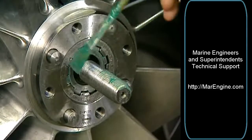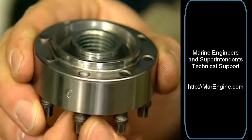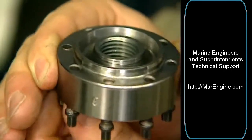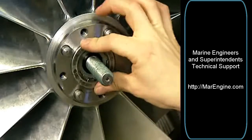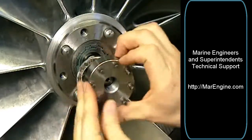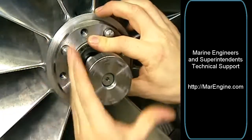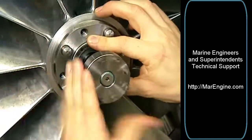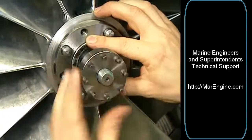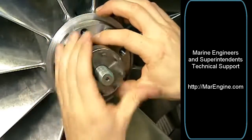Clean and lubricate the main thread with Molykote P40. Screw the thrust screws fully back. Attach the pressure disc to the compressor wheel. The pressure screws of the tension nut will leave imprints on the pressure disc. This is not a reason for exchange of the disc. Burrs on the pressure disc can be removed with a file.